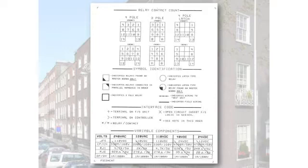The third page now. On the third page we give you contact count for the 3 style relays we use. We use a standard 4-pole relay. We give you, if you count the contacts from the front of the board or the back of the board. Again, with the 3-pole relay the same, front, back. The 4-pole latch, although it seems to be counted like this, is missing 2, 3, 6, and 7. So we show you that. We also give you front count and rear count.